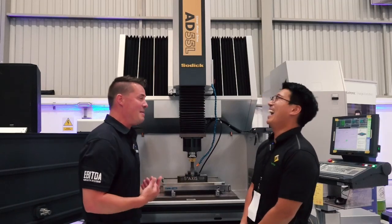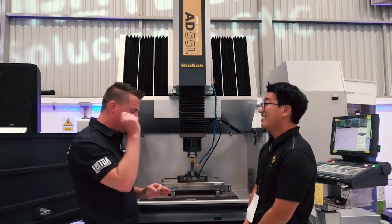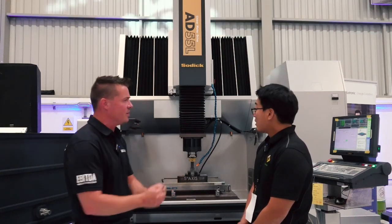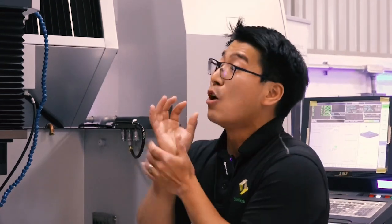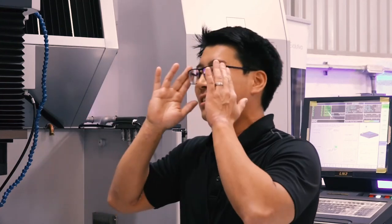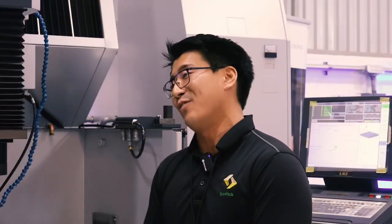Your energy is incredible — I'm already inspired to want to buy about seven of these things. Something that caught my attention: you mentioned graphite versus copper — what's the difference and why one versus the other? We are in an oil-based environment. Copper electrodes let you get closer to the workpiece, so you can fine-tune your spark gap to be even finer — you get a better surface finish and better accuracy entirely. However, graphite is used in 90% of the Sink EDM market because of the speed and production — that's what most customers want. But there is that copper electrode option if you want even finer surface finishes.